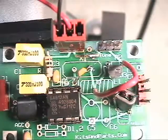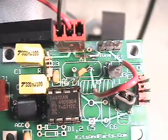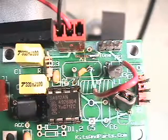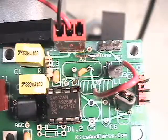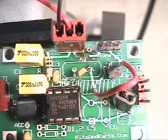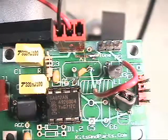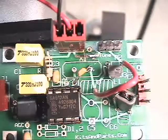Since then I've been using a current-limited power supply, which makes a lot more sense anyway. The power supply I was using when I hooked this up wrong would put out 10 amps, and that trace acted like a 10-amp fuse and went up in smoke. So if you're using the tune jack for anything other than what it was designed for, be careful — don't hook a ground on that left-hand pin.